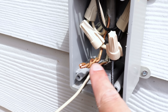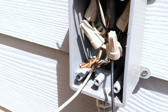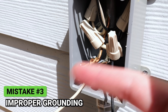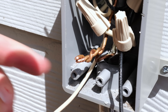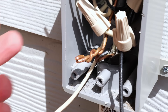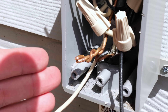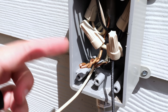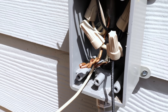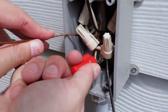Before I put the pigtail on the ground wires, this is where the next big mistake I spotted comes into play. There was no ground pigtail — that receptacle was not grounded in any way. Those two ground wires were just twisted together and sat in the back of the box; there wasn't even a wire nut on top. So just really wanting to quickly cover that: you just never know what you're going to find. In this case, there should have been a ground pigtail connected to ground that receptacle, and on top of that, there needed to be a splicing device on those grounds.